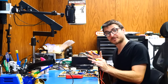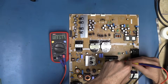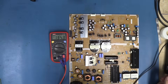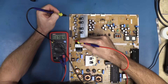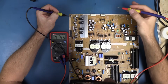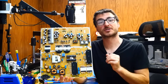Now that we've completed all of our repairs, it's time to live test. So let's plug it in — everything seems okay. First thing I want to check is my filter capacitors over here; we should be getting about 390 volts — 391, 390. That's good news; that means our repair is holding. Next, I want to check the output power to our main board from this connector. We have pins 7, 9, 11, 13, 15 that are supposed to output 13 volts, and we're getting 12.7, which is correct. I also want to make sure we're getting power to our LEDs over here — we're getting about 150 volts. This confirms we have another successful repair.